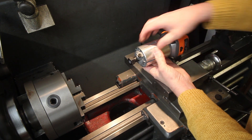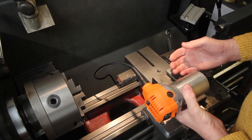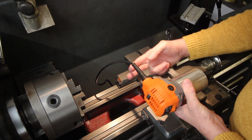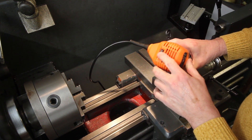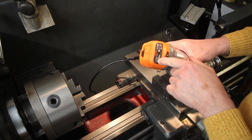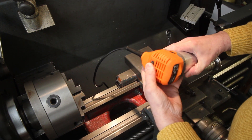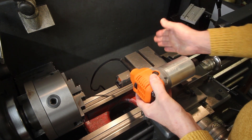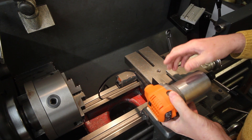I've decided to either make a new tool post and slot a tube to clamp the palm router in place, or put it to the side and have a secondary spindle — a proper grinding spindle — with a couple of pulleys to change speed. The minimum speed of 13,000 RPM is a limitation, and it doesn't have good load regulation. A pulley arrangement and gearing it down would actually give more torque.